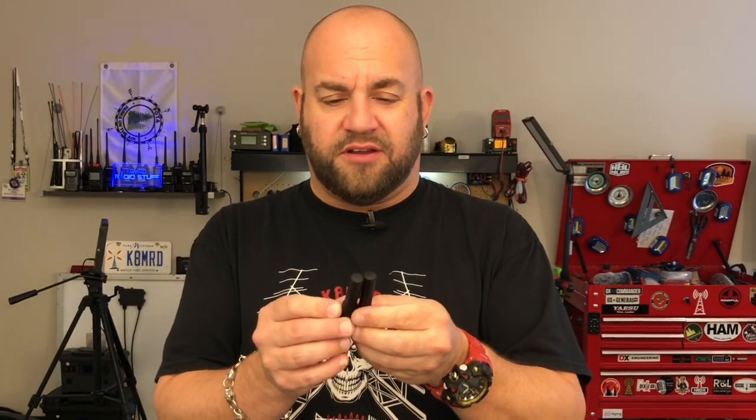Having antennas like this serve a real world purpose other than just for use with hotspots. I absolutely love these things. How good are these things? Probably not very good — I would suspect the SWR is pretty horrible. So let's hop on the bench. I'm going to hook this up to my antenna analyzer, try and use a counterpoise to get as good a look at the SWR on a handheld antenna as I can. And then I'll show you what I can achieve with the 705.